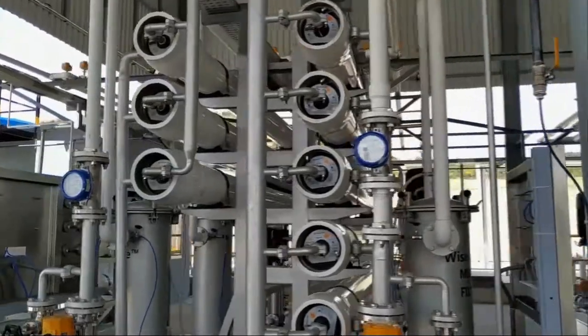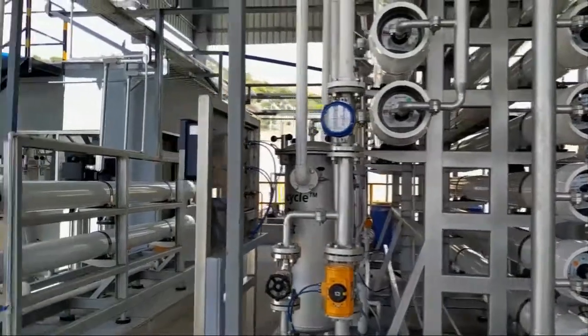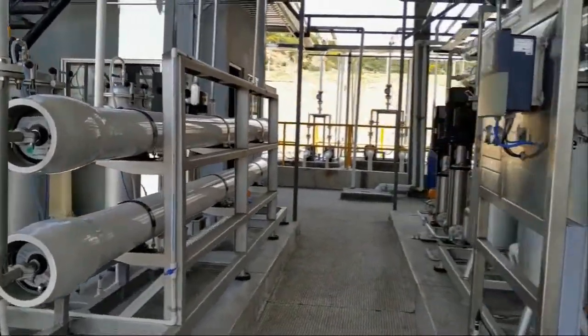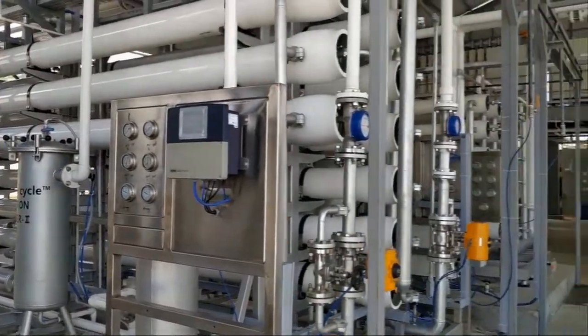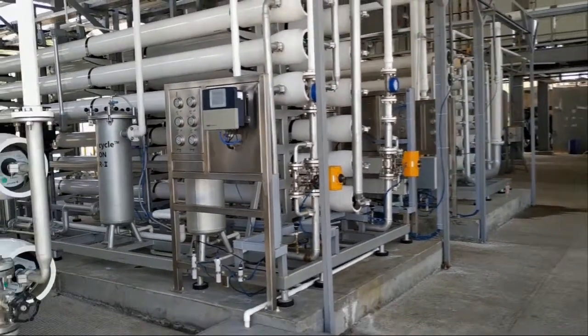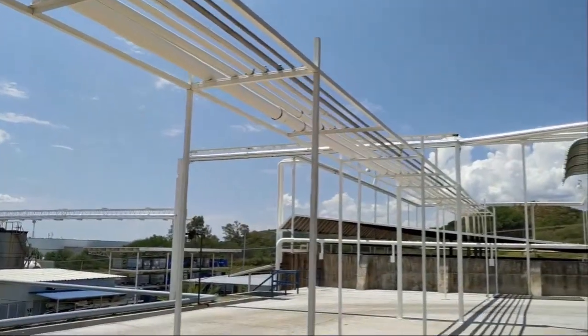Overall, 96% of the pure water is recovered from the multiple RO stages. The RO permeate water is pure and clean like potable water, free from hardness and salts, and ideally suitable for washing and dyeing processes. The RO permeate from all the stages is collected in a recycled water tank and then pumped to the laundry for reuse.